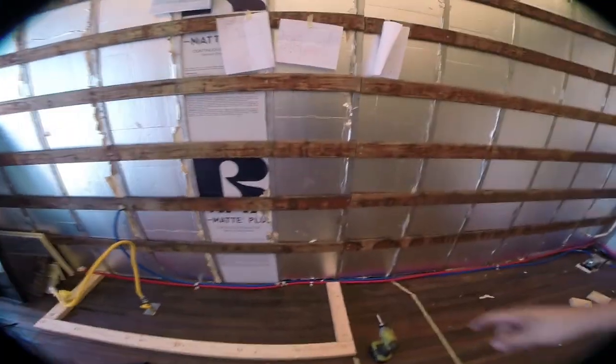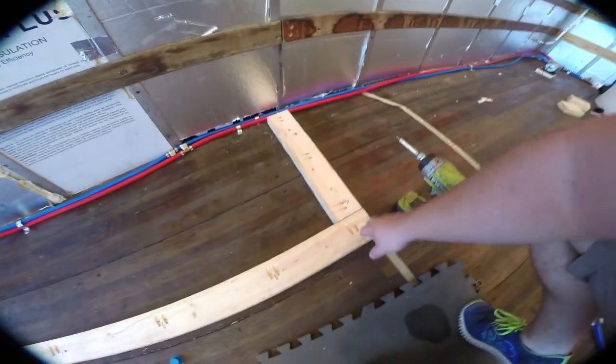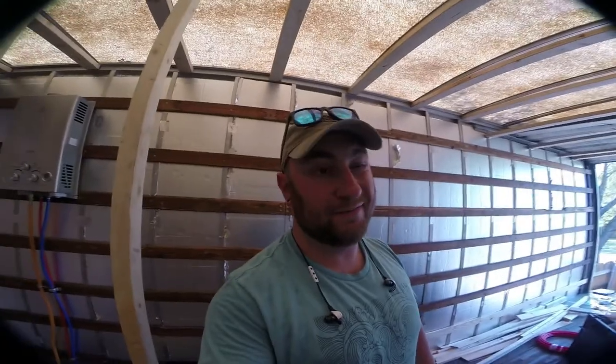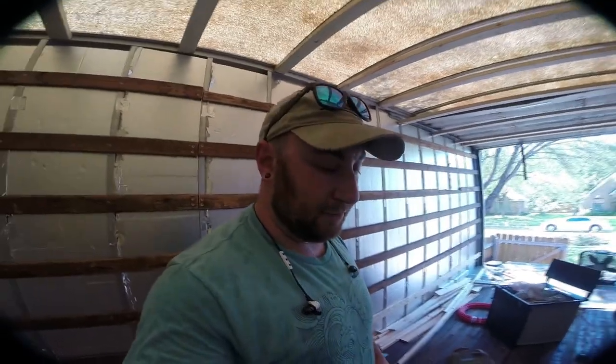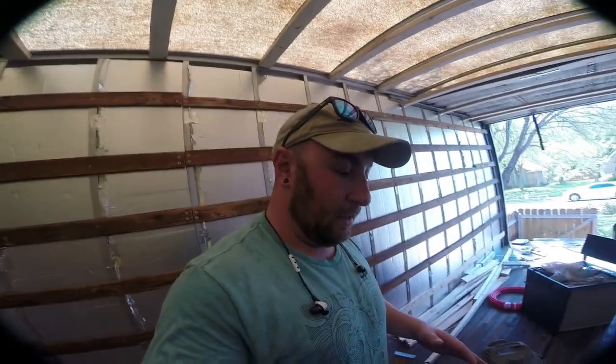So here's our base. I cut this two by four a little shorter to allow a pass-through for the water connections — this will all be hidden later. As you can see there's a bunch of little holes. These are pocket holes for pocket screws. I'm using a little Kreg jig. I'm not a huge fan of it, but it's really the way cabinets are built with this system. It's very strong and easy to use, but it's all proprietary — the plastic rig plus screws was like 50 bucks. This will let us mount the sides flush and screw them in from the inside so nobody ever sees the screw holes.